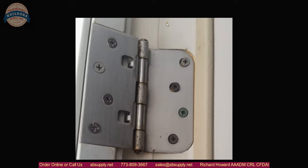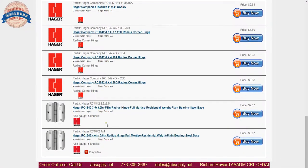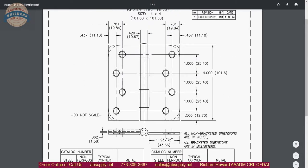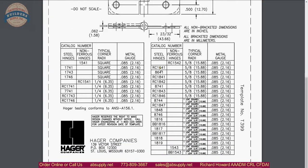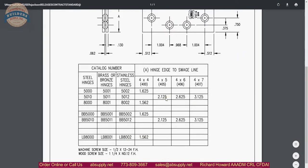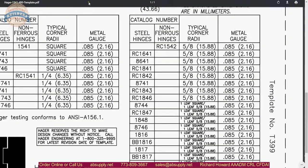But first, the leaf thickness of this hinge is very likely about 90 thousandths of an inch. A comparable residential hinge at four-inch has a leaf thickness of .085 inches — that's a very thin hinge. The four-inch Bomber hinge that we would be able to sell is going to be 130 thousandths. So the hinge is going to be substantially thicker, and that would have to be mitigated in order for any of this to work.